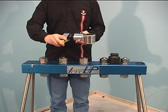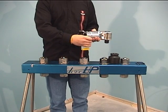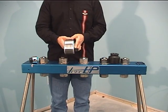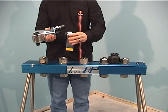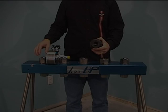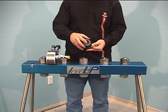To move the reaction arm, simply depress the reaction arm button and gently remove the arm. Place the arm in the desired position and slide it into the spline space around the end plug until you hear it click into place. The reaction arm can be positioned in numerous places within a 360 degree circle. It will always be toward the lower half of the housing in the same direction as the square drive.